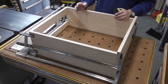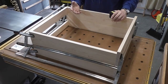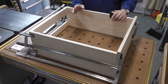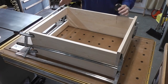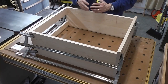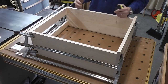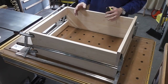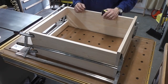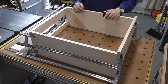Another thing he did was he used bridle joints quite a bit on the doors. Not only is it nice visually with the exposed joinery work, but it also makes it a lot easier to lay out. Because I know what this distance is right here and the bridle joints go all the way to the end, I can make those cuts as an exact measurement. So I'm going to start by ripping the stock down for the rails and stiles, then cutting them to length, then cutting bridle joints and putting it all together.